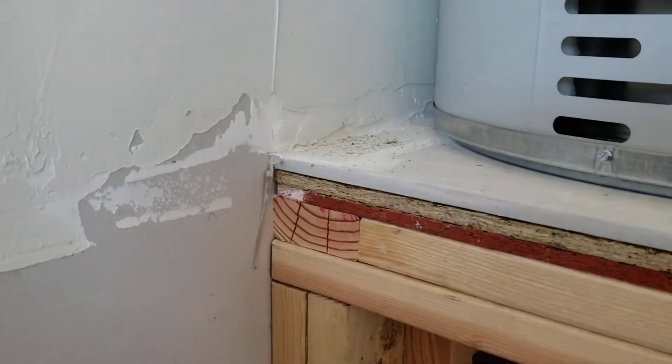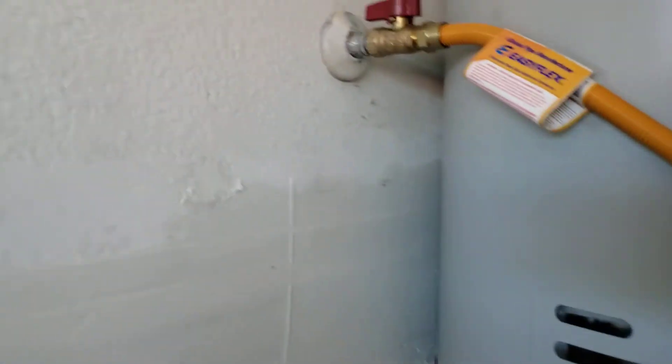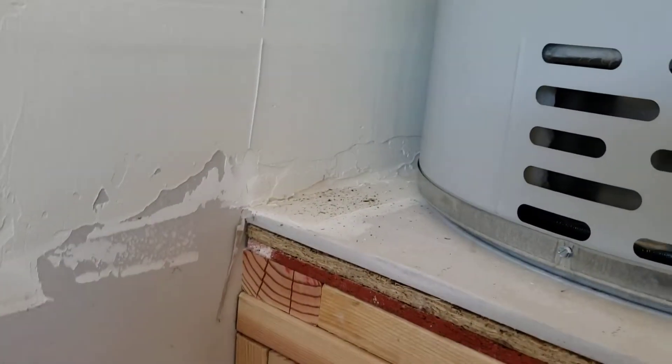On this wall we demoed back to where there was no more moisture going vertically up the wall. Over to this side, outside of the water heater area, it is saturated, but to replace that you just need a drywall guy — or do it yourself, cut it out, put a new piece in. That's our drywall where we screwed it, all the way to the back, and then it's taped and joint compound on it. The platform itself we put 5/8 drywall, and then tape and joint compound, so it's all sealed like it should be.